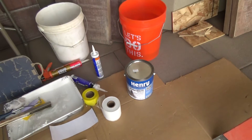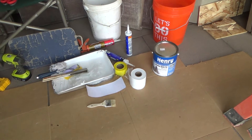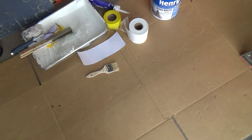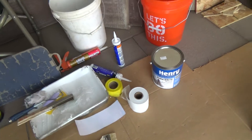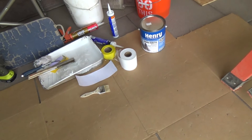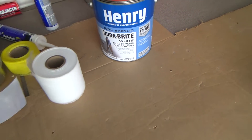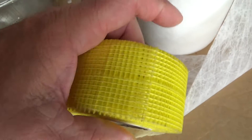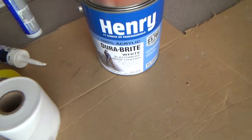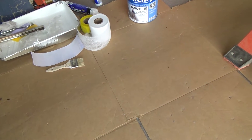I knew they had some white elastomeric type stuff because I've used it years ago around roof curbs for air conditioning units on commercial buildings. I used to build the roof curbs out of four-by-twelve or four-by-six material, rip it down and make it flat for the AC guys. Then I'd get the flashings done, go to the store, get this stuff — something like this, probably 15 to 20 years ago. I would put the webbing over the flashings and on top of the roof deck, do two or three coats over that, and I never had a leak or a complaint.